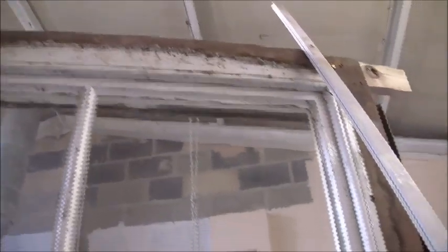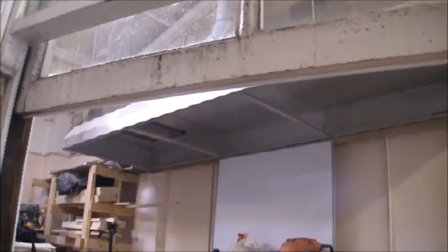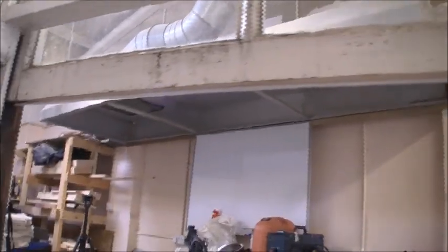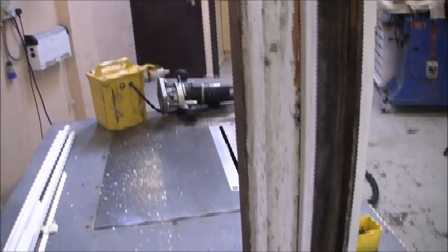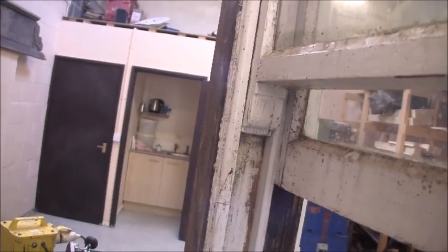So when that's closed, up there you know that you've got a brush right in the top and you've got a parting bead all the way around. The centre, the meeting rail of the lower sash, when that comes down, will seal the gap in here, and then under here you have another brush that's running along the bottom rail, and again you have the parting bead with its brush going the other way, which is sealing against this outside face. Once the staff bead is in anyway, that will basically just squeeze up to there, so the whole lot will be sealed.